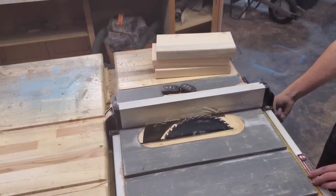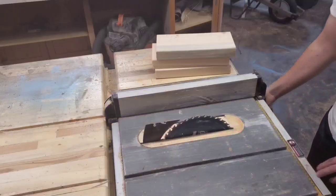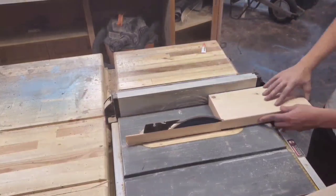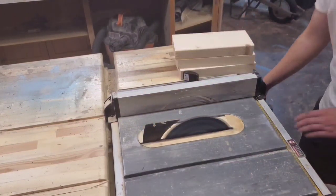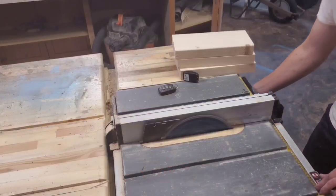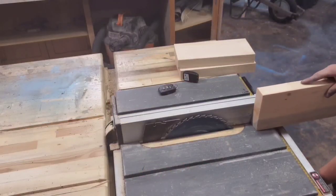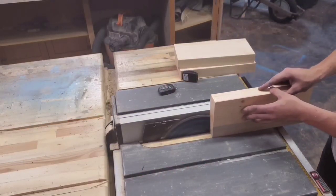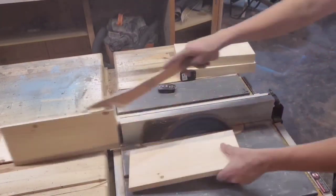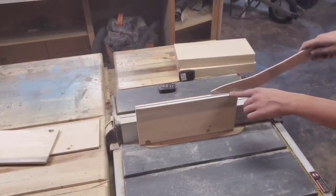But before I can put all the stamped sides together, I need to make the bottoms of each box. I still have three of those 11 and 7/8 inch sections. So I'm going to take off about a quarter inch from the side of each of those pieces, so I'm down to about 5 1/4. And then I'm gonna resaw each of these into 4 1/4 inch boards. That'll leave me with 12 of these. I only need 10, but that way I can choose the best ones.